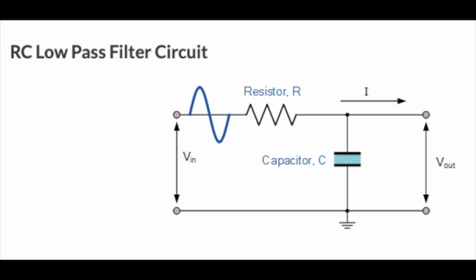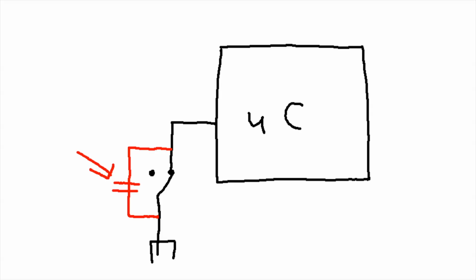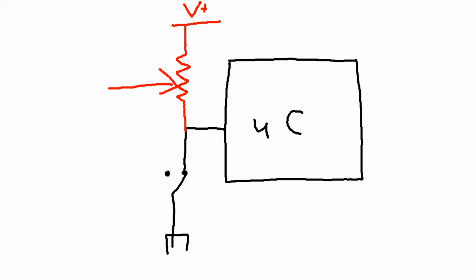There's also other electrical kludges and workarounds that you could do. You could add a debounce circuit to it, which again is going to limit your click rate. You could also do an old industry trick and bypass the switch with a very small value capacitor like 0.1 microfarads, and that'll help kick a spark that'll let it break through the wetting current, although again this is just another kludge. And while we're adding electrical components, you could just add another resistor in parallel with your internal resistor, pulling it up to your voltage rail. That's going to bring the current through the switch to like a milliamp or more, and that would definitely give it longer life, but at the risk of frying your microcontroller if you do it wrong.